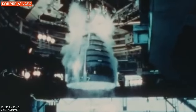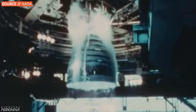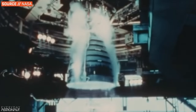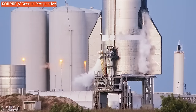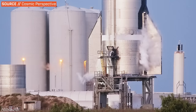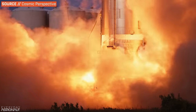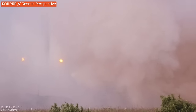For example, when the RS-25 was on the Space Shuttle, there was a limit to how quickly the thrust could decay so as not to exceed the orbiter's structural limit. The initial oxygen preburner oxygen valve motion was limited to 45% per second, and the main oxygen valve also had to be closed at a particular rate to ensure sufficient back pressure on the turbines so they wouldn't accidentally overspeed during shutdown. To me it's just crazy how many considerations there are for absolutely every single input and condition — there are a million lessons that frankly can really only be learned the hard way by examining scraps of an engine and trying to figure out what went wrong.